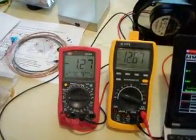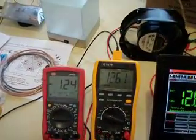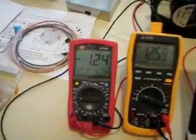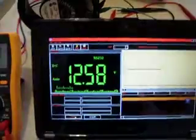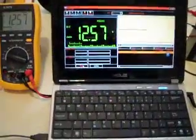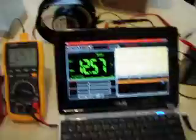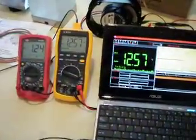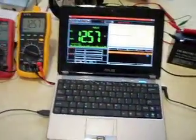I've actually got my amperage connected the wrong way around, but that shouldn't matter. Okay, you can see it's dragged that battery down 0.4 volts already. It is running at 1.24 amps. And my graph here will be showing me exactly what's going to be happening. So I'll run this, see that it's dragged it down this far. I may only run it for about an hour, see the fan running. I really don't want to kill this battery, but I want to do this test just to see exactly what will happen and how fast it's going to drag it down. Okay, I will see you guys later.